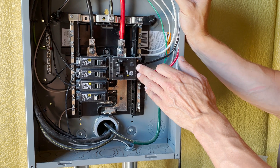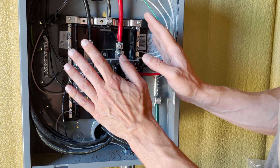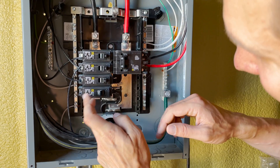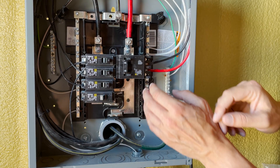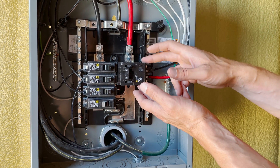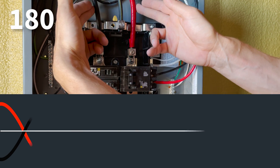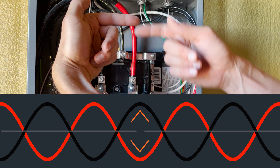Now with 240 volts it's actually just as straightforward. I want to clarify that this is a dead panel, so if you're working on this, turn off all the electricity — don't fry yourself. If you look at this, you've got your two incoming power lines and the way they come down is they separate. This circuit breaker is attached to one line as the hot, and this circuit breaker is attached to the other line as hot. Something like this 240 volt 50 amp breaker — which is for our RV plug — is actually touching both of them, so now you're getting that out-of-phase 240 volts. As one leg peaks high the other peaks low, so when one is up 120 the other is down 120, and you get your 240 volts.